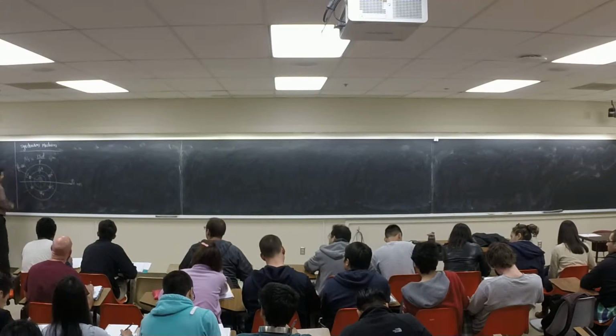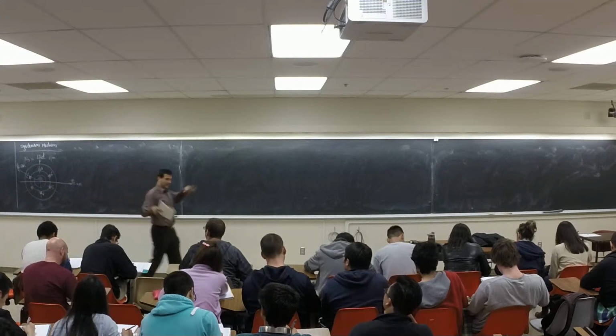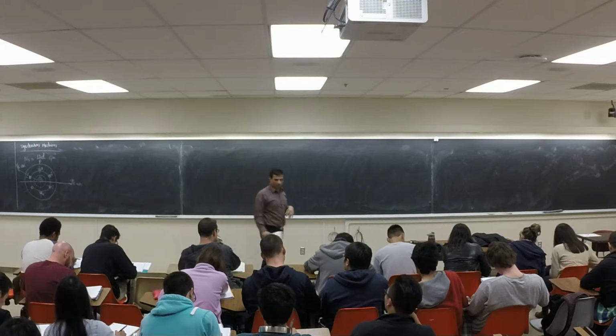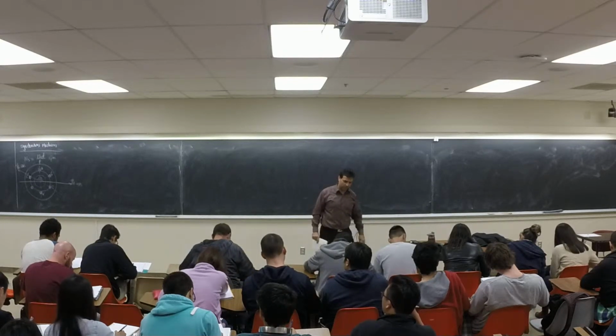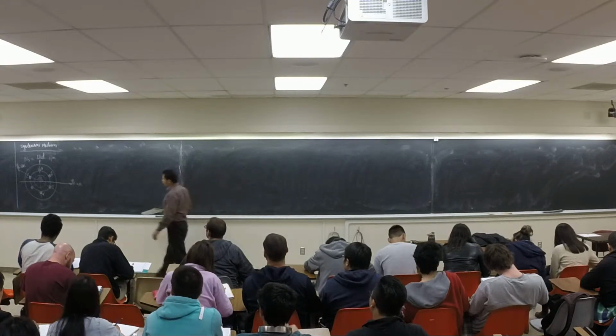And C is going to be here. I'm not going to put C here because it's going to get parallel. I don't want to put that one. We have phase A, phase B, and phase C, right? We have three magnetic axes, one for each. Now, let's put the rotor axis here.